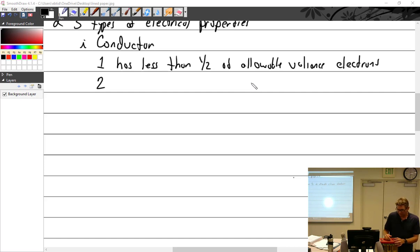All right, but take it a step further, because now you know electricity, now you put it on volts, right? And you put it between here and here, and you should read? Nah, it's difference of potential. So there's no voltage drop, should be no voltage drop. So you get nothing. You tell your buddy, go ahead and hit the starter.